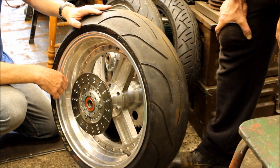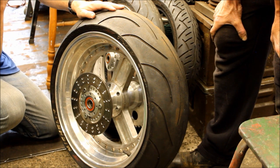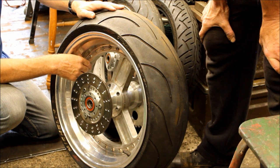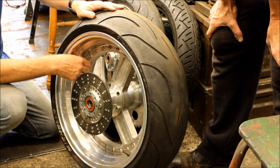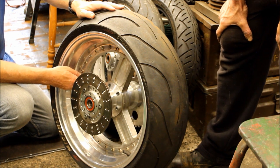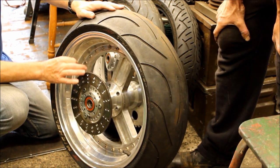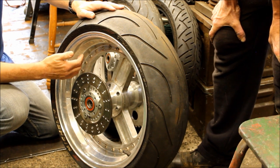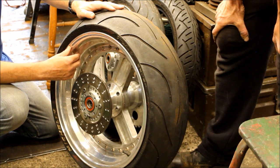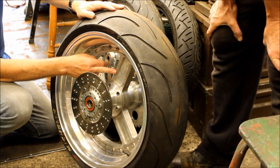Well, we could mill the weld away. Yeah, you could machine it away. That's a lot of work, so I'm not going to do that. But what I could do is take the hubs off and do something with them, anodise them or whatever, paint them, powder-coat them, and mask off the rim from this centre, and either paint the rim and leave that alone, or paint this and leave this alone. At the moment I'm thinking, leave the rim polished, which makes life a lot easier when it comes to changing tyres and keeping the thing chip free, and then do something with these hubs and the centre.